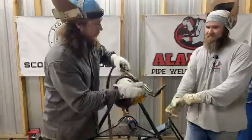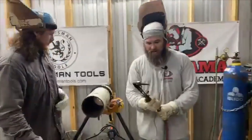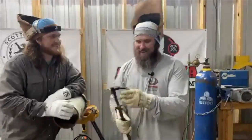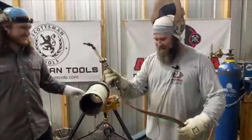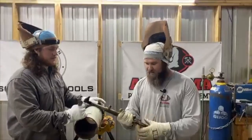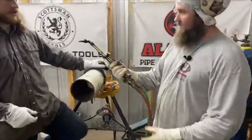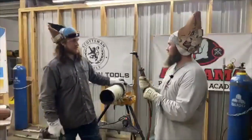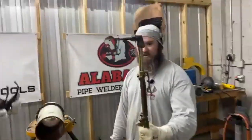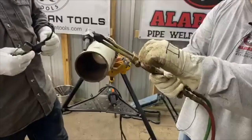So Trey, talk to them a little bit about the gas pressure and stuff like that. We set the torch on in the bottles. So right now we have oxyacetylene. We got the acetylene set at 125. No, I'm just kidding. At about 10 PSI, and then we got the oxygen about four times that, so about 40 to 50 on the oxygen, about 10 on the acetylene. Don't ever go any higher than 15. Why not go higher than 15? It's just unstable. It's unsafe. So what we have here, I'm sure you guys know what a torch is. You got your high pressure, you got your cuts, and then you got your fine adjustment here for the valve.